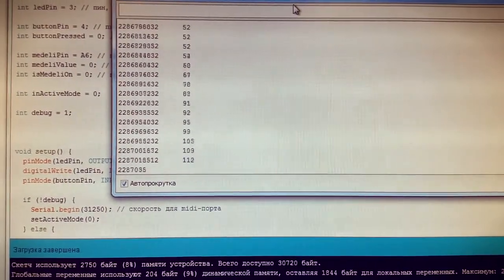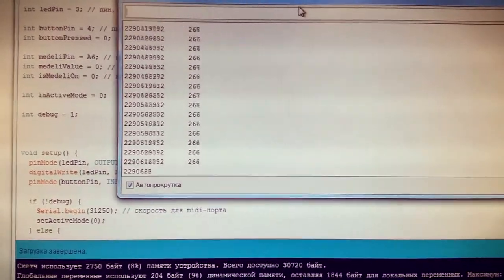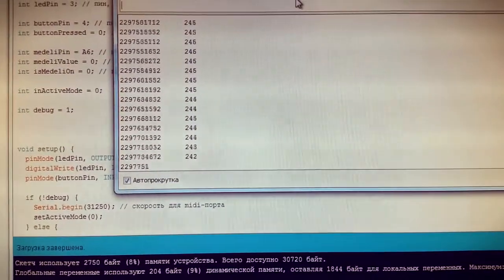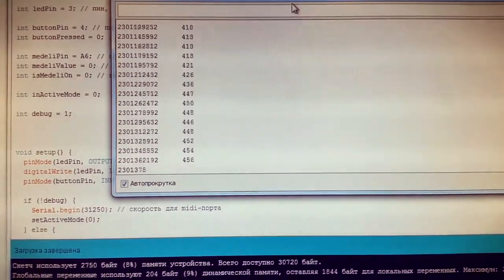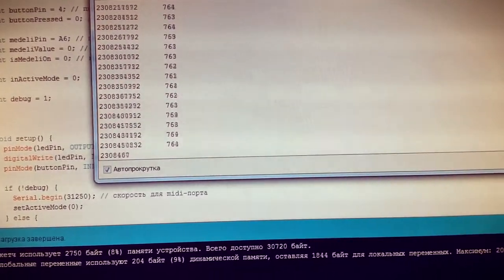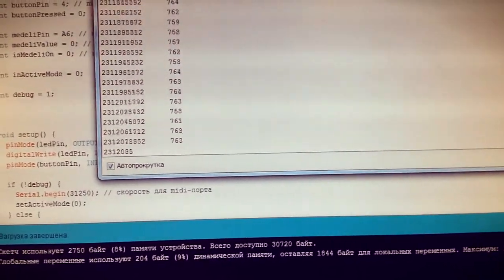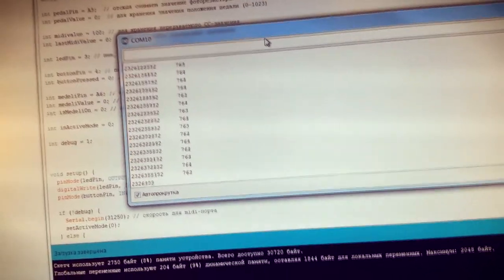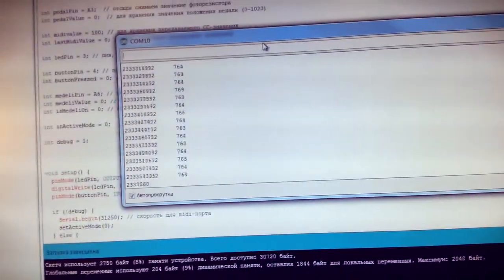This is closed A, this is closed B, from say 40 to 300. This is closed B. Then it will be opened up to 770. Okay, from 760 it will be fully opened, and between 300 and 760 I have 3 other opened heads, open A, B and C. So I'll just divide it into 3, and I will send CC only if hi-hat really changes its value. I will not send intermediate values, because then there are too many CC messages. The next day.